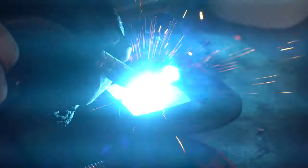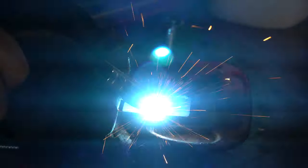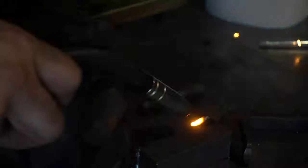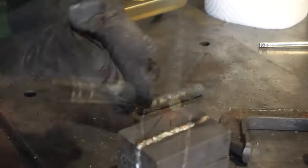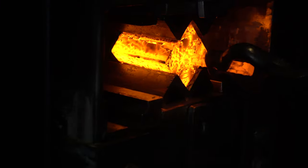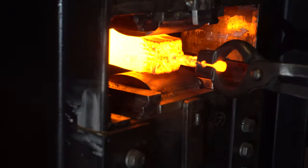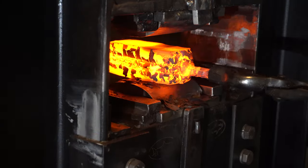Here's where I learned a new trick by first doing it the hard way. I wanted to make sure I sealed this whole thing up, so I welded all of the seams including the sides — and that presented a problem. As soon as I put this in the squaring dies, it squished that weld into the seam and pushed it in deeper than I wanted. I had to grind that out, which wasn't much fun. But the good thing is I learned a cool technique that I'll show you in the next forge weld to combat this.